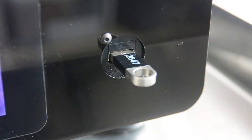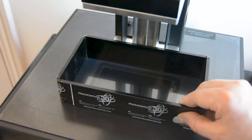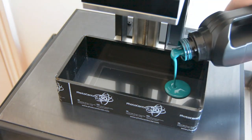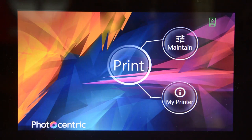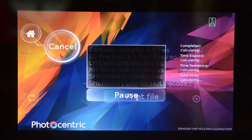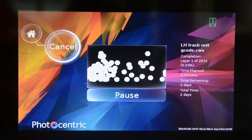The files are now transferred onto the printer via the USB stick. The stick can then be removed and the first print run off. With the build plate attached, a fresh vat is placed over the screen on the base plate. The chosen resin is then poured into the vat — in this case the blue precision mould resin. The shroud over the printer is then replaced straight away, preventing any early curing taking place. The touch screen interface on the front of the printer is really easy to use; just select the file and hit print. It then displays the print layer by layer as it prints, together with an estimate of the printing time. For this part, the slicer software estimated 10 hours, but the print took 22. I wasn't too concerned — I'd just have to reassess the slicer estimates.